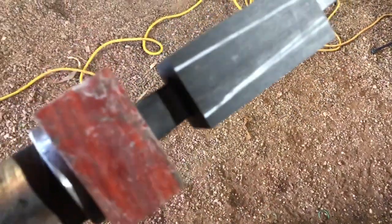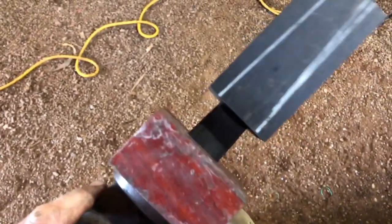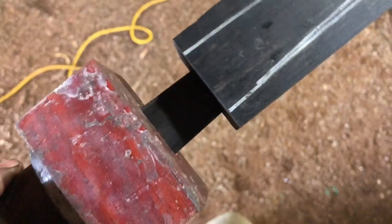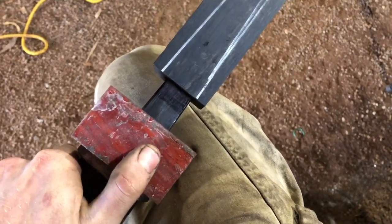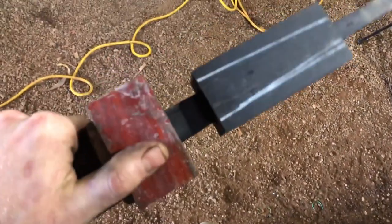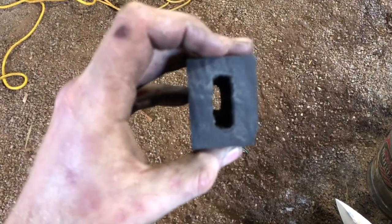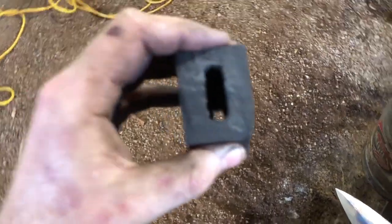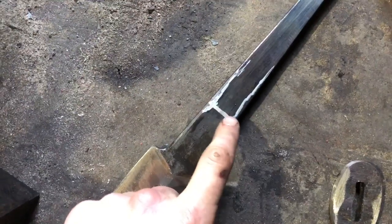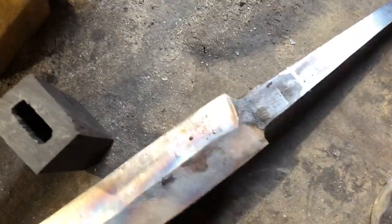Running into a bit of an issue — the block of ebony isn't quite all the way up to the wooden bolster, and after fitting the tang there's not going to be a lot of material left to sculpt the handle. I don't want to hog any more out. I've got more tang than I need, so I might narrow it up starting inside the upper bolster — make it a little easier to fit up and give me more material to work with for the contours. With the way the tang is sitting now we don't have a lot of material on the top and bottom to make the finger grooves. I've marked out where to take material from the tang — this line is the bottom of the wooden bolster — just need to remove about an eighth of an inch total.